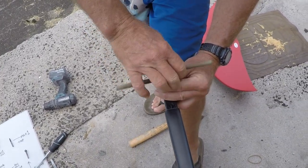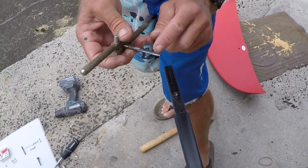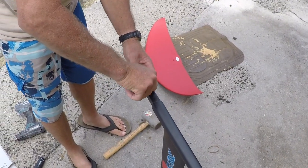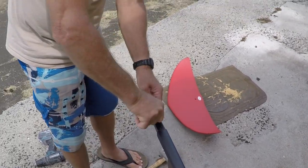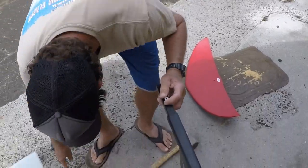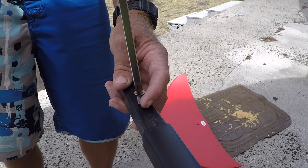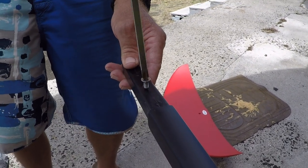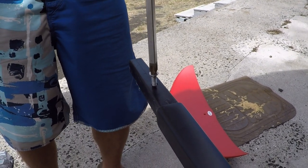It's totally stripped. When you do your taps, try and keep them straight up and down — don't let them wobble all over the place, otherwise your threads are going to be all over the place. Now I've cleaned up my threads and I can get the screw to go back in there again. I got to where it wasn't the point of no return — I cleaned up my threads, put a tap through there, and you can put your screw in it again. But use a brand new screw because you've already buggered up your screw.